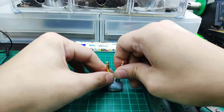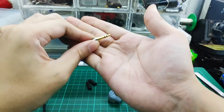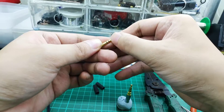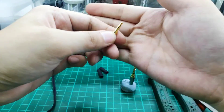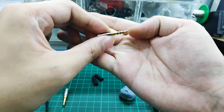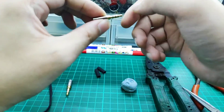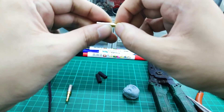What's the difference between these two? The number of contacts. We have 3 contacts for the standard headphone jack — for stereo: left, right, and the common ground. It's only for audio output. Whereas the TRRS, the 4-pole jack with the mic input, has stereo, a mic ground, a common ground, and the mic signal itself.